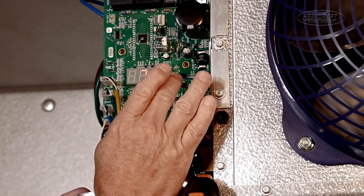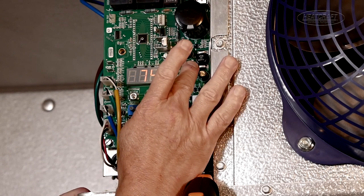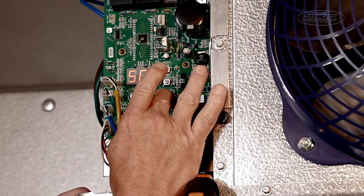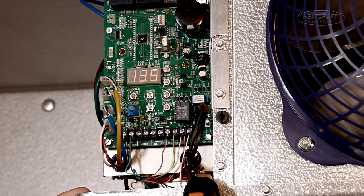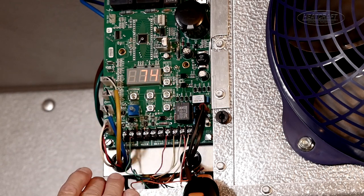The next one is our suction transducer, and this is going to be SCP under monitor. That's going to show you what your actual suction pressure is. In this case our system is not running, so our pressures are equalized and our suction pressure is showing 135 PSI. But you can put your gauge on your refrigeration system and compare your gauge to the display on the board. Hit clear test to go back to the main screen.